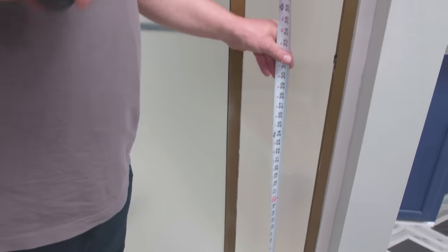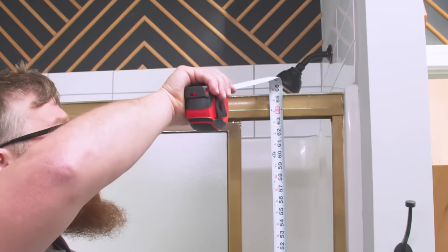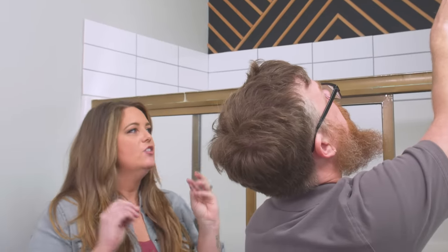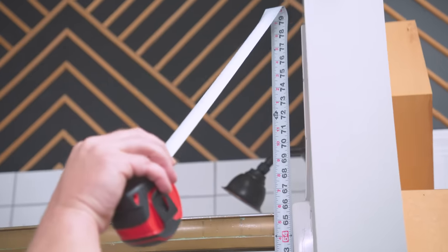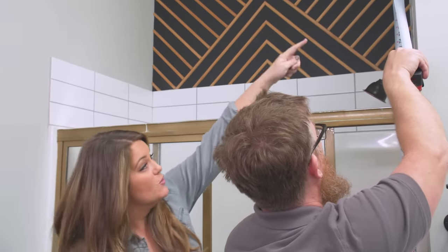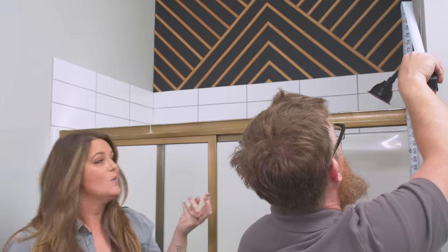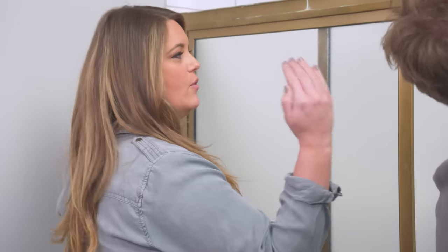For the height of this door, it's too short — I'm 5'8" and I'd almost be hitting my head. It's clearly builder grade, cheap, and as small as possible. We're going to take this a lot higher. Ben measures 78 and a half inches — almost 12 inches taller than the existing one. It'll mean our shower will be attached into the tile, but I've chosen a door that will fit this width and give me the extra height I want.